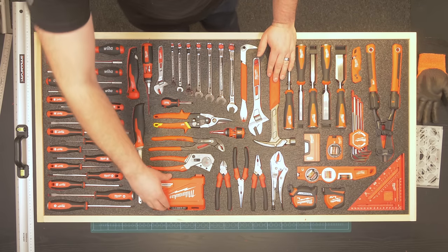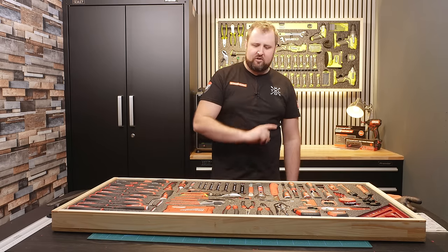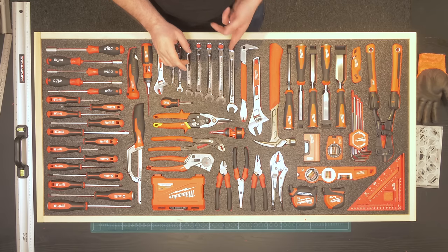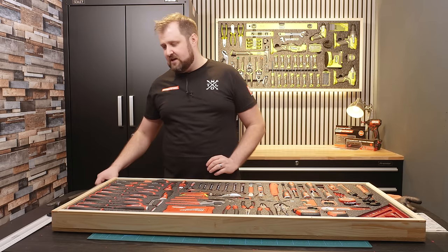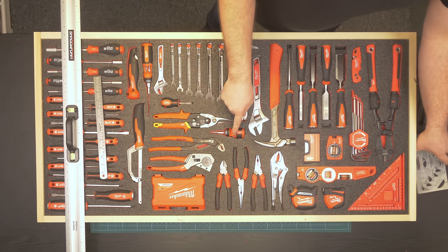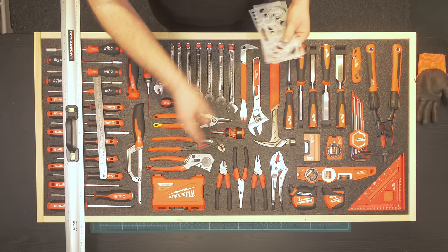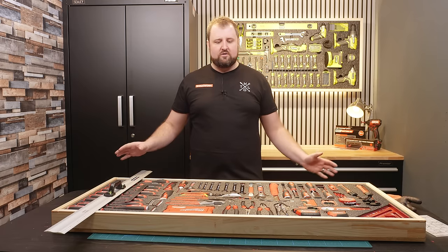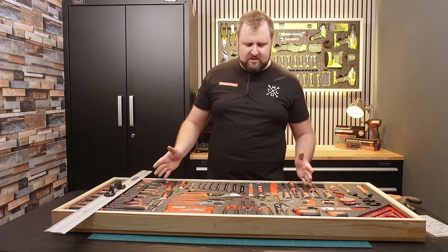The cutting was very simple — just cut around, peel. Most of these tools are cut quite deep too because this panel's going on the wall and we want everything to stay in and not fall out. But we're not quite finished yet because we need some finger pulls. You don't have to have finger pulls — they are a personal preference. For some items like the spanners you can just get your finger in the ring on the end. But I like adding finger pulls and tracks. I use a steel ruler because it's a finger's width at 25mm — that's how I do the tracks. For odd little items like this screwdriver, I'll use a stencil set and do a little semi-circle, cut that out, so that individual item is easy to get out.